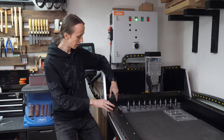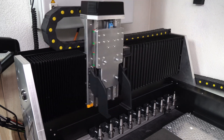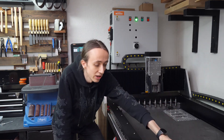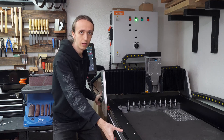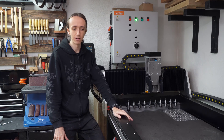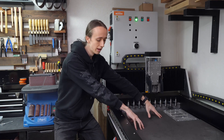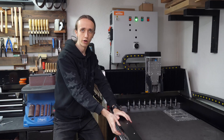On the x-axis there is stuff in the way anyhow, so having to go in a little bit further and losing some travel does not actually impact me because I cannot machine out here anyhow. However, on the y-axis I can very easily move all the way to the front and machine on my vertical surface and go all the way to the back. So if I wanted to add bellows here as well the machine would have to be 10 cm longer on either side, and my workshop is already out of space, so that really was not an option. The next best thing is to help with gravity and have this kind of protected overlap. The chips and dust will be mainly created here, spray out, and land here — hopefully not too much on the linear rails.